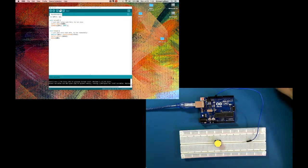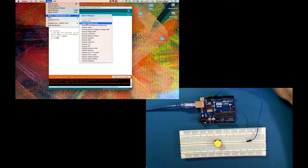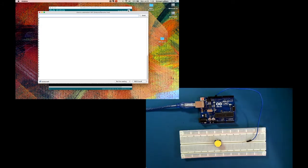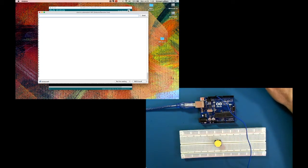I'm going to upload it now. There was a problem — let's make sure we've got our board and port. Our port was not selected, so we have to go ahead and choose the UNO. Now it's uploaded. I'm going to go over to the serial monitor. Pin 12 is basically acting as an antenna, just picking up stray electrical fields and giving us a kind of random output — either ones or zeros depending on what it's picking up.